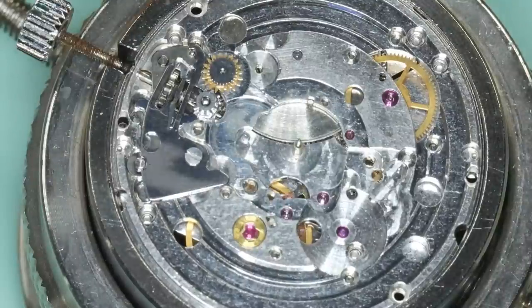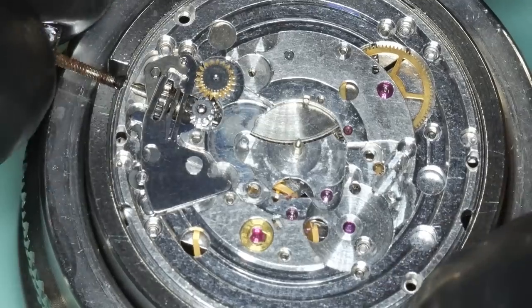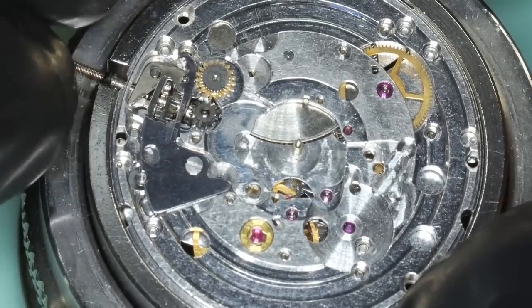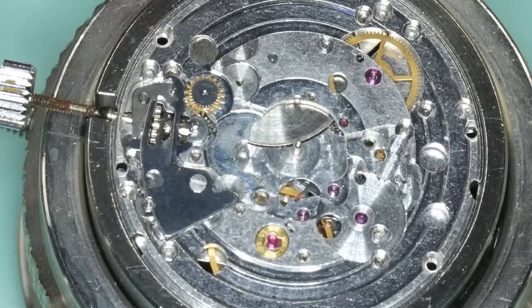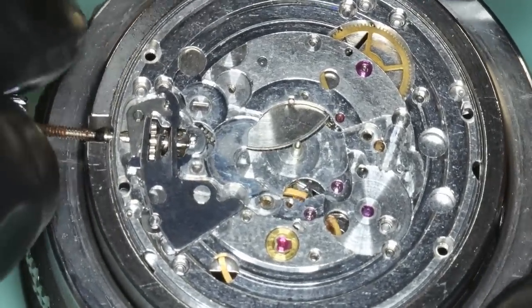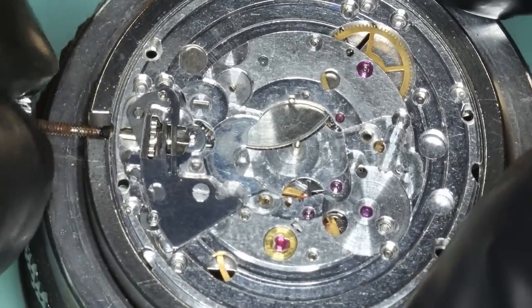What I have noticed, well obviously you can now see that the watch is running quite well, really. What is more is the crown is in full, and if I turn that, that's actually winding the movement. Pull it out and we're hacking. Excuse the wheel jumping out, no big deal. Should remove these two anyway. So the stem is correct. There's either something that was wrong in the keyless works, or the stem has been cut too short, because that is 100% definitely operating as it should.